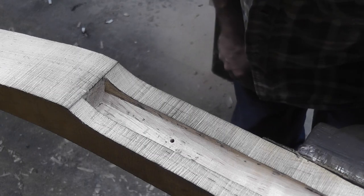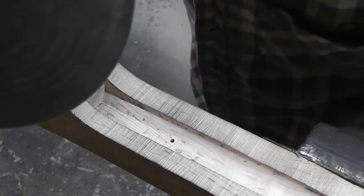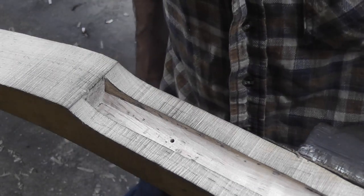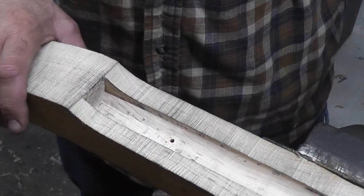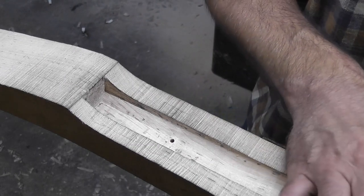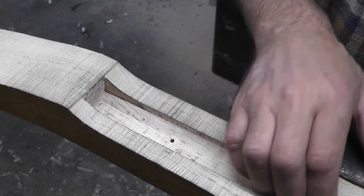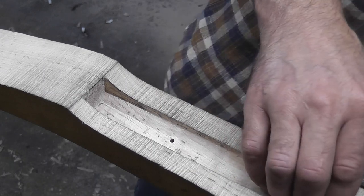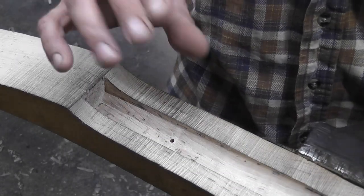It looks really good to me. I'm printing really well. My black is wearing off the barrel a little bit, but I think that's good. We're going to call that good, and next we're going to measure our barrel channel to ramrod channel — the web in between there — to see how they are in relation with each other. That'll give us a nice slim gun.